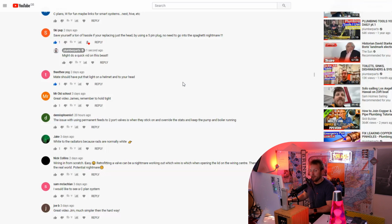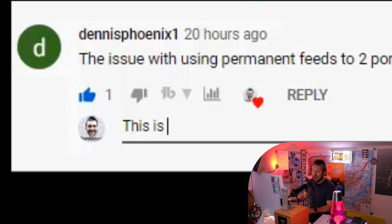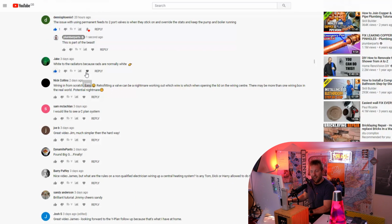Mr. Old School: great video, James. Remember to hold tight. Thank you very much, Mr. Old School. The issue with using permanent feeds to 2-port valves is when they stick on and override the stats and keep the pump and boiler running. Exactly right, Dennis Phoenix, but this is part of the beast. White to the radiators because rads are normally white. Ah, I like that, Jake.